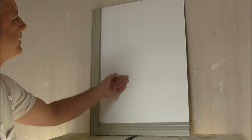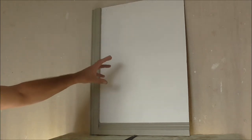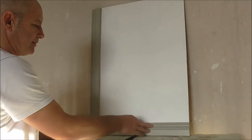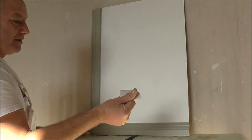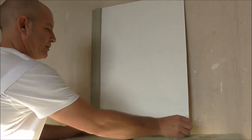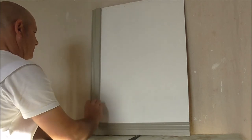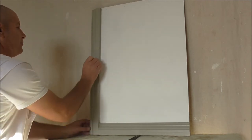This is dry now, so paste is still in there. So you think, you know, the job's finished, and you go away and leave it, and then you come back for a colour change. Well, I'll show you what happens there. But at the minute now, treating this as if the wall's finished and you're carrying on with the woodwork. Oh, I've already lightly rubbed down this skirting board. I'm using a P180 because generally you come to a job, if it's all smooth and there's no nibs, you won't really need anything rougher than this. So then you rub down the woodwork, the edges. Now, remembering that the paste is on here and formed a layer, so into that groove there.